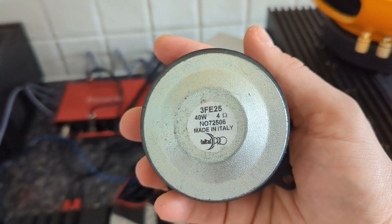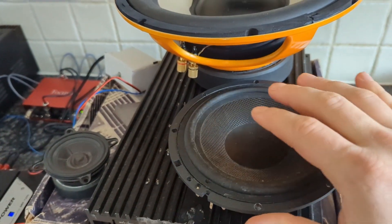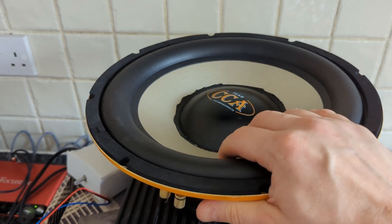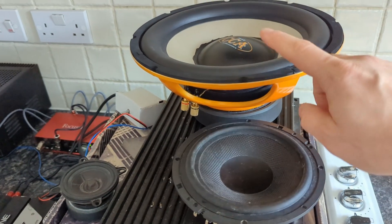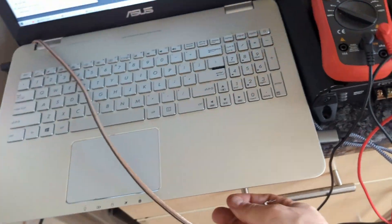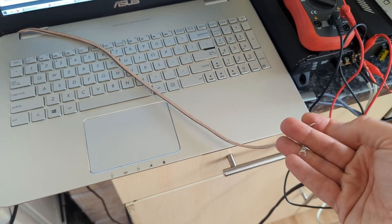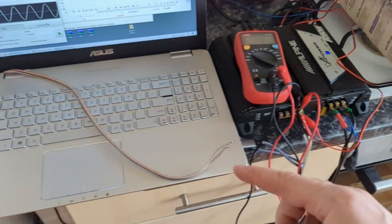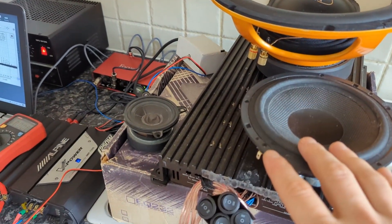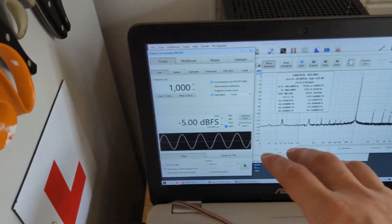I have a 3.5-inch Focal Pro rated at 40 watts, a mid-bass that James sold me, and James's subwoofer with a fairly high Fs of about 60 Hz — so those will be somewhat similar, but the difference will be in inductance, since the subwoofer will have much higher inductance than the mid-bass. I also have a wire going into my room where the Status subwoofer sits in a large sealed enclosure, and that subwoofer dips down to 2 ohms. Every speaker is going to have a different impedance curve, so I will do an impedance sweep for each of them to see where we end up at 1000 Hz.